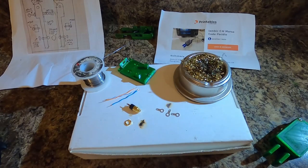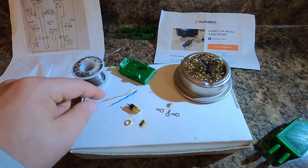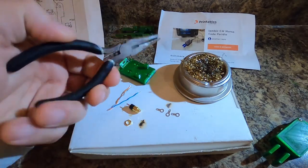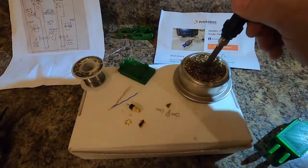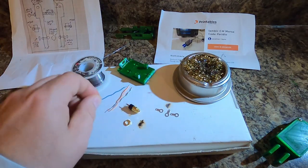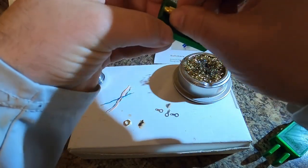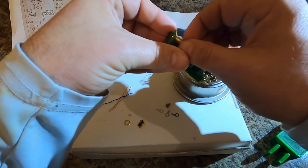Right now, we're gonna use the audio jack, and you need three 2-inch wires for this particular part of the project. A soldering iron, some solder, maybe a dirty needle nose plier or whatever size nut driver you might need for that. What we're gonna do is solder these wires to the contacts of these guys, the little tabs, and solder it to this. But I recommend installing the audio jack first, because you might have to spin it, and if you have wires attached to it, that is going to be a little bit of a pain.